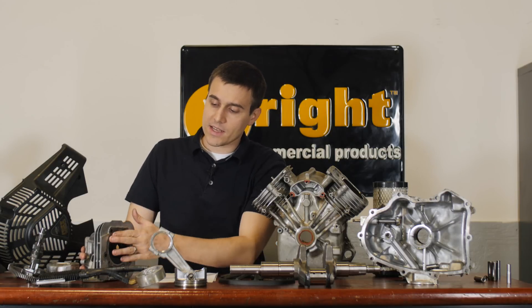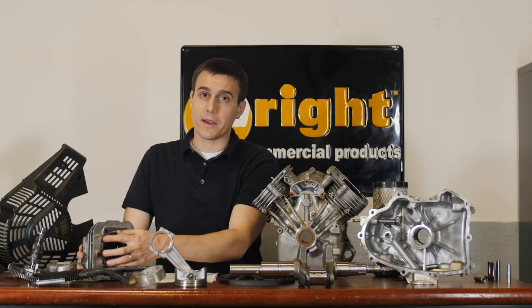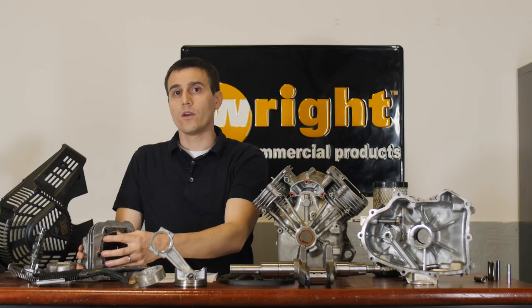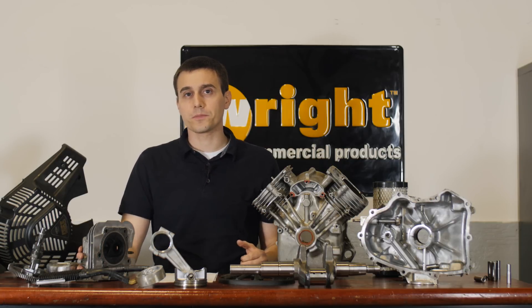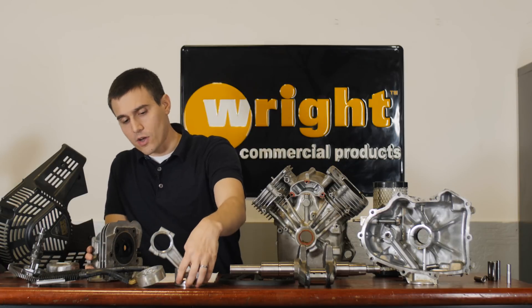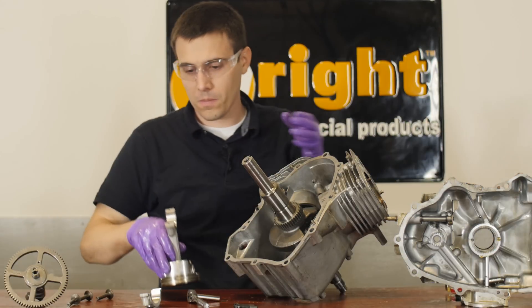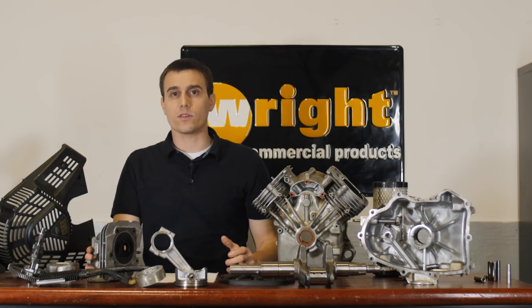We also have a fire ring head gasket on this engine, so right near the combustion chamber there's a steel ring. That ring is going to better resist any blowout when the engine's running under peak torque, which is when you have your peak pressures. We also have plasma-coated piston rings, and that will add durability to the engine — something you'd only see in a piece of equipment that's built for a lot of hours and a lot of work.